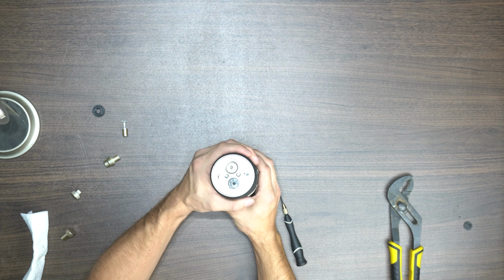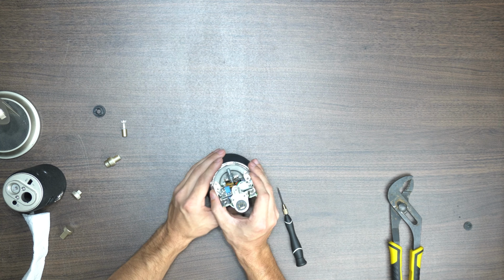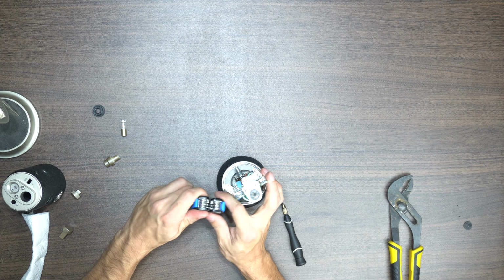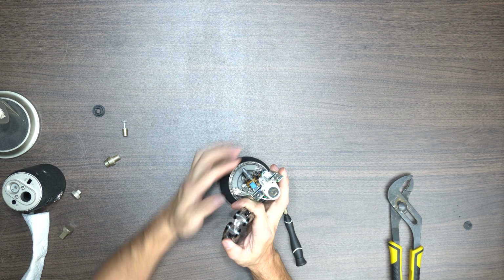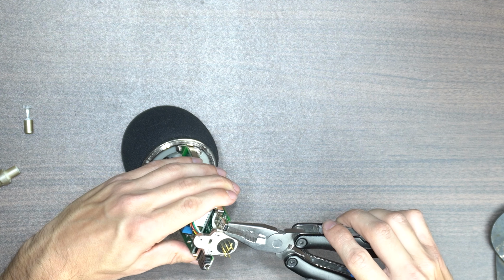After all 3 screws are removed, you can now slide the cover off of the microphone and expose the internal components. It's inside of here where we can see the culprit of our issues, the mini USB port. If your USB cable wiggles around at all in this port, you will eventually have an issue as your cable won't make a good connection with the port and cause a myriad of issues, such as flat audio, clipping audio regardless of gain settings, large amounts of static, and connectivity issues, amongst many others, I'm sure.